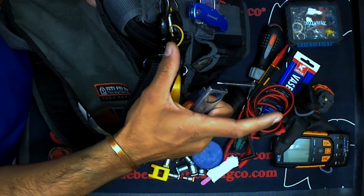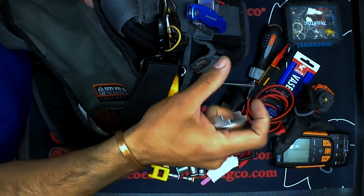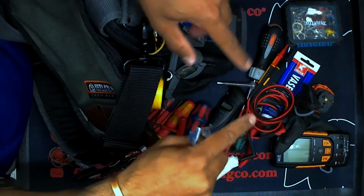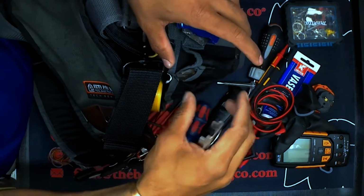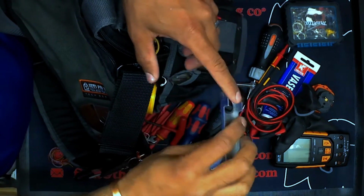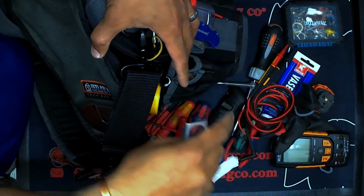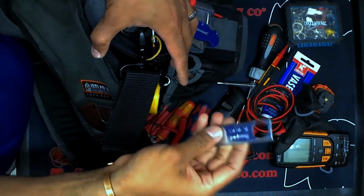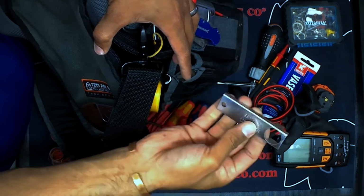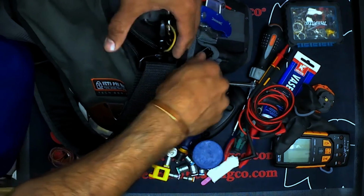It's basically a VC8010, I think the number is, the plastic head with the brass body, but the plastic cartridge in the middle with the flowery shape middle bit with a spring-loaded cartridge. Just slide that on top, undo it, take the cartridge out, brush the valve a little bit and put the new cartridge in with a bit of grease. That's what this is. This comes with the kit, and I always keep it as a spare in my tool bag.